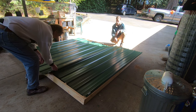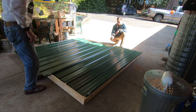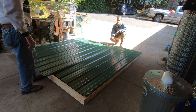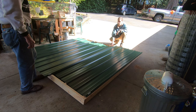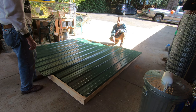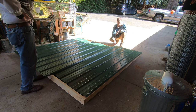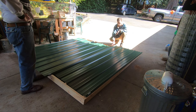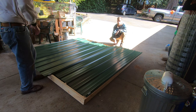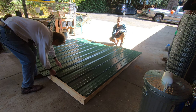I'm going to say move this one here over to here. But then there's no screw to hold it, because we need to screw into the flat part. I've got to add another 2x4. Yeah, but I'm saying rather than just doubling up the 2x4, does it make sense that you'd have it spaced this width apart, so that flat 2x4 can be screwed into? No, because these definitely stack. That's your lock. And that's why a lot of times they go right through there.